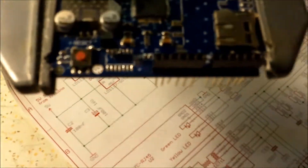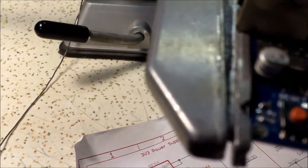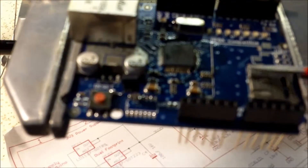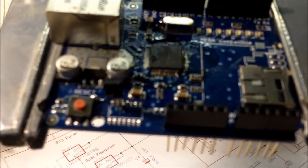That's all you have to do. I test it first, then take a little hot glue and put a small dab just to protect the transistor. The good thing is it's not higher than the shield headers, so it'll still stack nicely. According to the Arduino website, to deselect the board you write pin 10 high - that turns the shield off and allows you to use other SPI devices. Write it low and the shield turns on. Hopefully this mod is easy for you - ask any questions below.